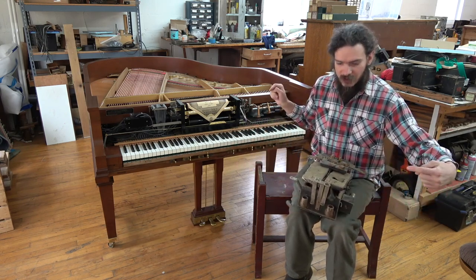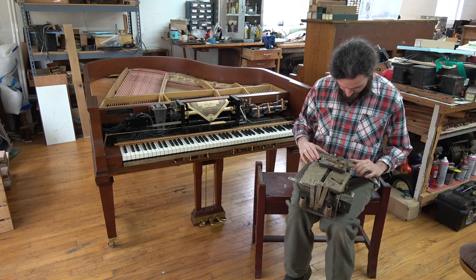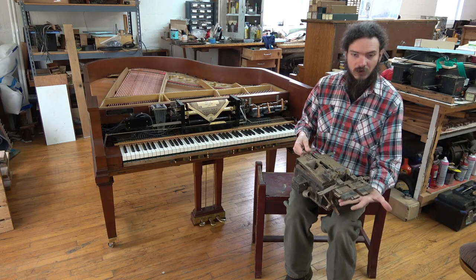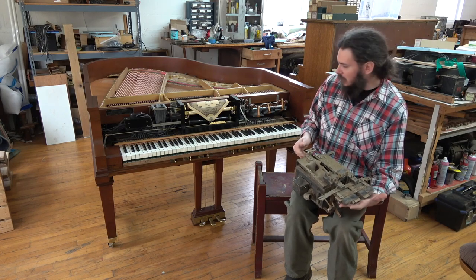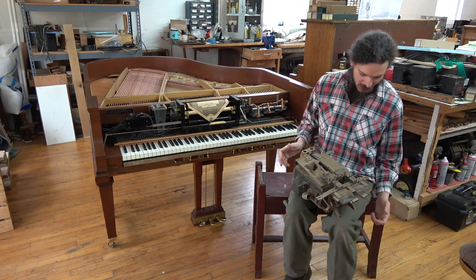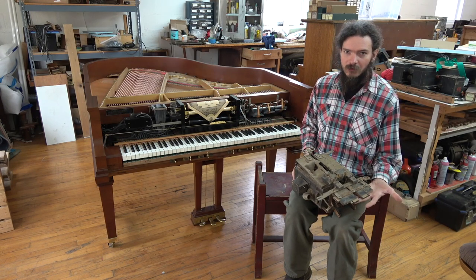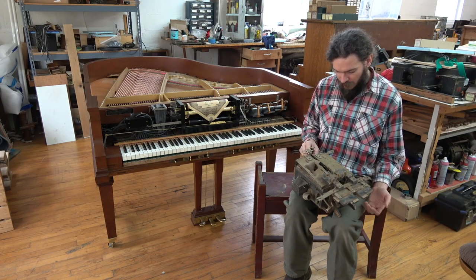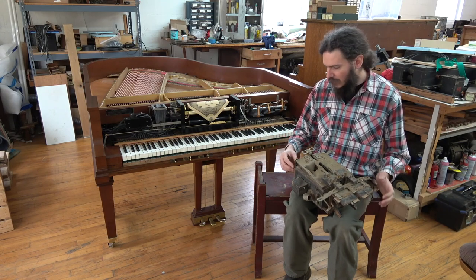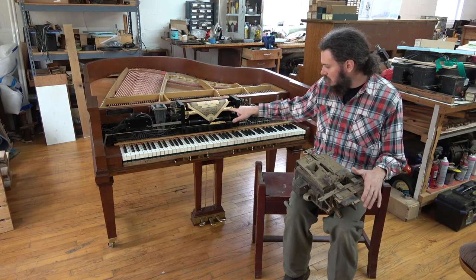And this goes to the two different sides of the stack. This one is the accompaniment, and this is the theme. On this side, which is not here anymore because it fell apart, there's a kind of accordion that collapses or comes back depending on which of these are open. When one of these opens, one section of the accordion collapses. So using the combination you have basically an inch total travel, and you can change it in 1/16th increments. That regulates how much air goes through a valve in here, which gives you how much vacuum you end up with in the stack and how loud it plays. One side does pretty much the whole accompaniment throughout the whole range, and the other one does the theme, which plays only when these other holes are open.